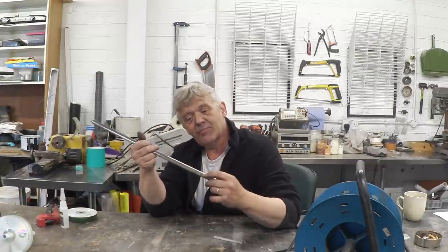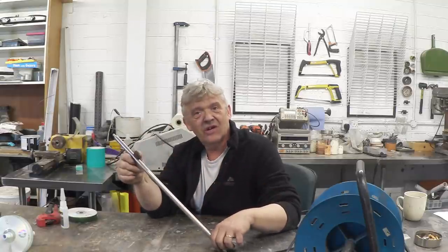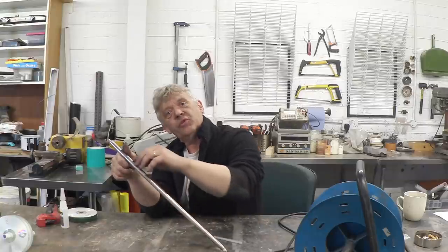Hi, so we're going to talk about the Archimedes screw. There are a ton of videos out there on the Archimedes screw for a very simple version. Basically you take a central rod, get yourself a pipe, wind the pipe in a helix, turn it and it will pump the water up the helix from low to high. Really easy, really simple, brilliant. But unfortunately no good for an actual generator — it won't operate in reverse.